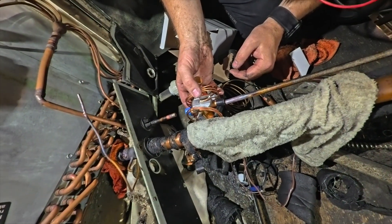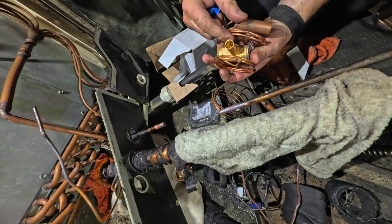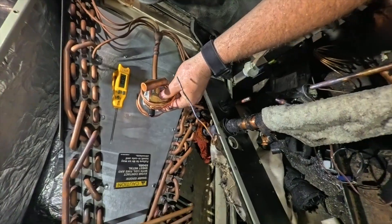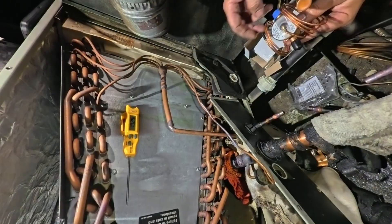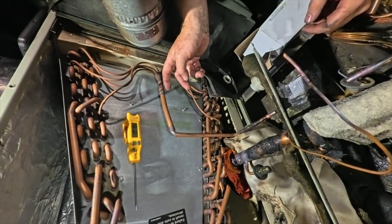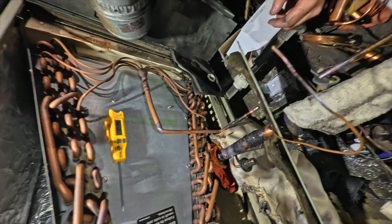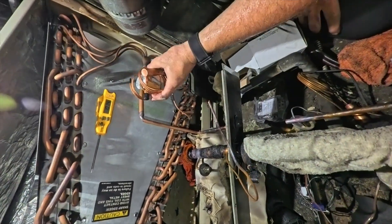This side is a half-inch pipe — it's fatter. I think I might just put it here, because this does not look like a factory setup. You can see there's a coupling right here — I bet this used to be over here. So what I'm going to do is take this off; they probably just cut it right there, and we'll sweat it on right there.